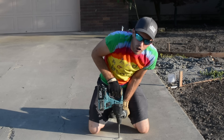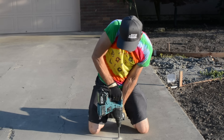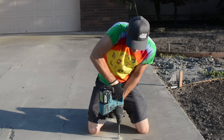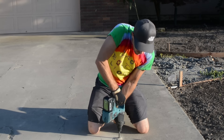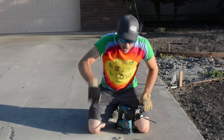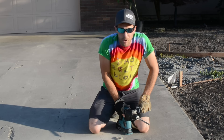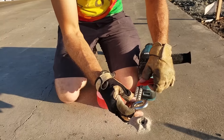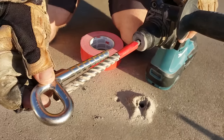So we're going to drill it all the way down. Notice I have safety glasses. Driveways are only four inches thick and I just blew through it, but rocks are not. One trick you can do is put duct tape on the drill bit where you know you need your hole depth to be, by just lining up your bolt with it.